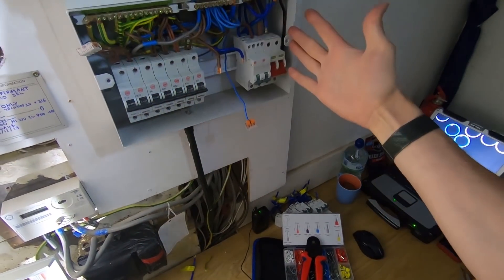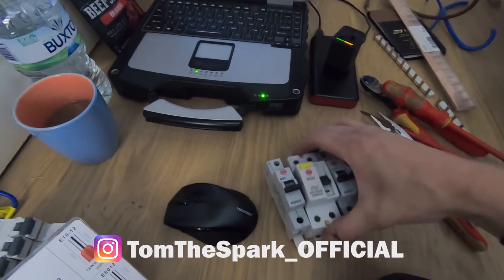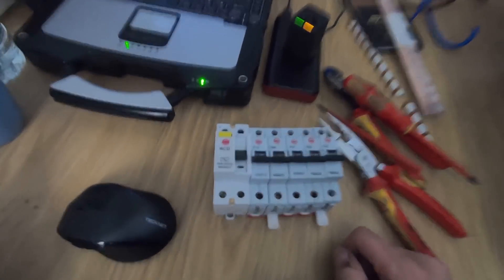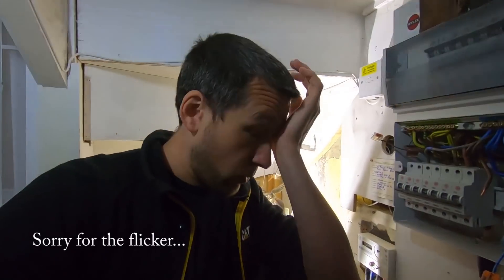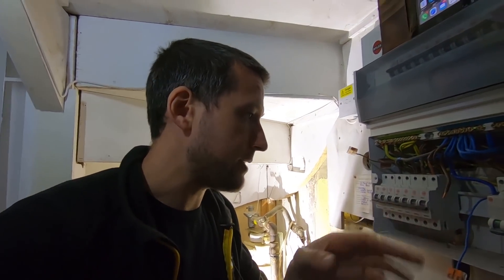Another day, another upgrade - kind of. They had two boards here; we're leaving the top one but the bottom one has all the power circuits and sockets. They had a front-end RCD and just a load of breakers, but the problem was it kept tripping. It wasn't actually a fault with the RCD - it's literally the amount of stuff plugged in, because everything has a little bit of leakage, maybe one or two milliamps. You only need to plug in ten or so items and you can effectively reach the point where the RCD trips.